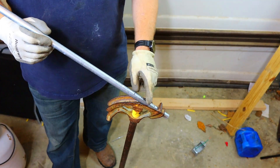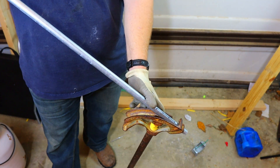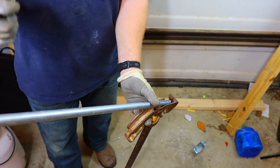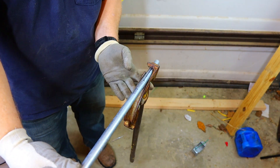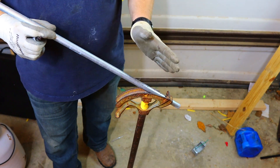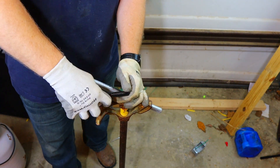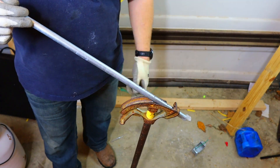So let's talk about using that guideline first. This line goes all the way down the conduit. What you can do is take and put a reference line on your bender, and then you can line it up with that line so you always know where to put it in. Box offsets — I have a full video on this. We're going to go ahead and bend these together. Let's put it in there and bend it.